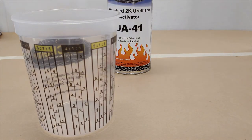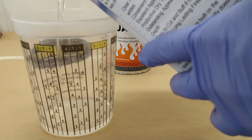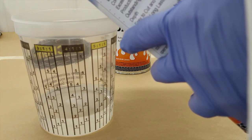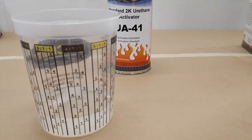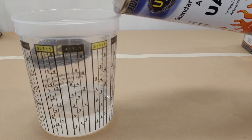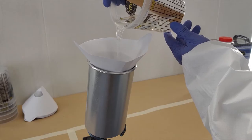There is no need to shake this clear coat prior to opening. In fact, shaking the can of clear can cause microfoam that can end up in your finished product. UC410 mixes 4 to 1 by volume with Urochem's UA series activators. Measuring and mixing is made easy using the 4 to 1 column on the Urochem mixing cup. Mix gently, then strain into your spray gun.